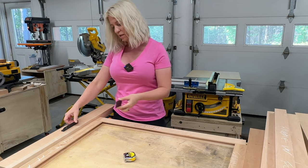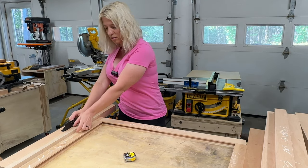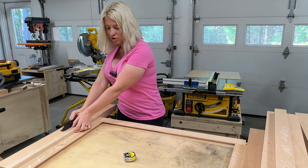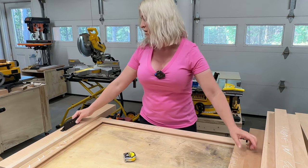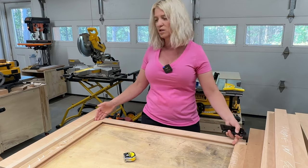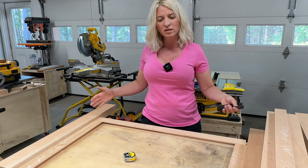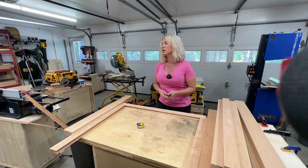I'm gonna put it kind of like in the center, and then the rail is going to go like this. So you see, I will be gaining about 1.5 inches on each side from each leg. So 1.5 with 1.5, that's 3 inches. With the 36 gives me 39. That is 1 inch wider than my mattress, so I should have a little bit of wiggle room.